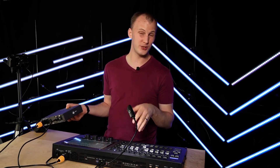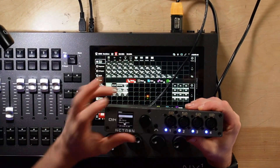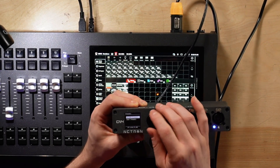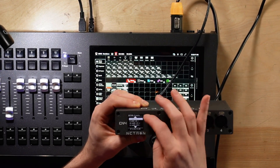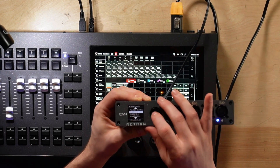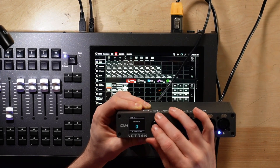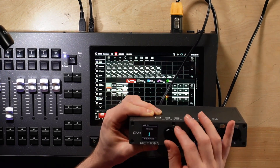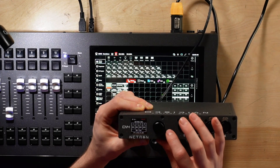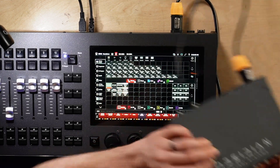There are a couple of things we need to do to get output. First, I'll do the node. I click on it, scroll down to Presets — the top item — Netron Presets, go up to the top and select number 8: sACN 2.X. Universe 1 is what it would be with sACN, and that's what it tells you. Back out of that, you're set up — you have an IP address and it displays that you're on universes 1, 2, 3, and 4 on your four ports. Done.